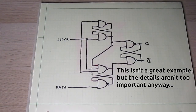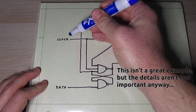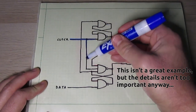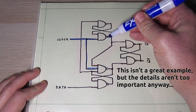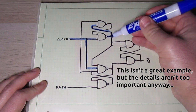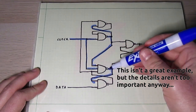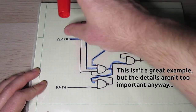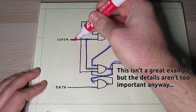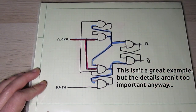The clock is generally going to be used in some sort of edge-triggered flip-flop. By tracing through the gates, we can see that the clock signal might need to snake its way through several gates before the output of the circuit actually stabilizes. So even if the flip-flop is ostensibly edge-triggered, it still takes time for the edge to propagate through the circuit, and if we change the clock again before the edge has fully propagated, weird things can happen. In other words, very short clock pulses can cause incorrect data to be latched into a clocked flip-flop.